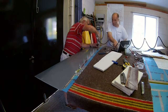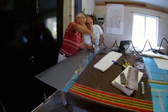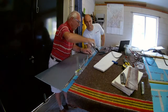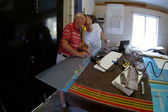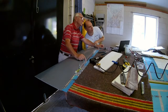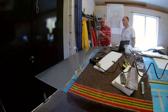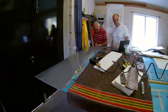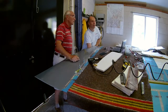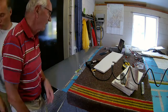Then there is the question: should you use blind rivets or flush rivets? I decided I want to minimize the use of blind rivets. I think you can probably do it with blind rivets structurally, but I don't like it. So I'm going to do everything with normal rivets, which is a challenge because there are places where you cannot, or it's very hard to reach.